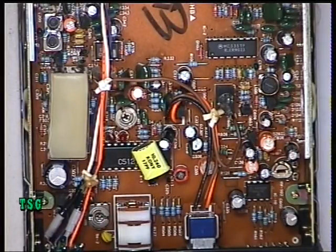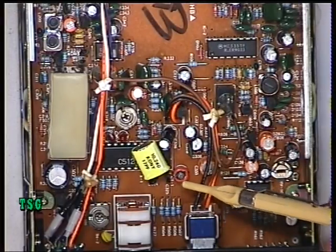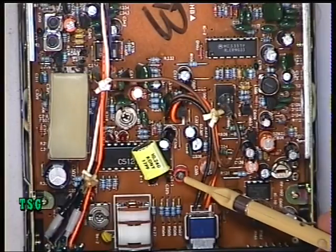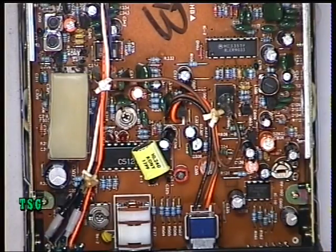We're on channel 20, so we should be on 27.79125 MHz. Start going into transmit — and it's reading 27.79122. So after all these years it doesn't need adjusting — that's certainly near enough. It would be that trimmer capacitor if we needed to trim it. Now because this has been tuned before, it's going to be doing hopefully everything about right.